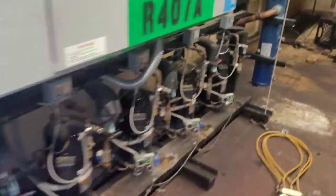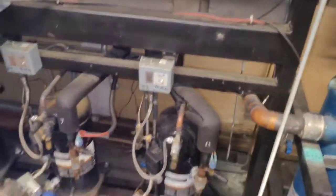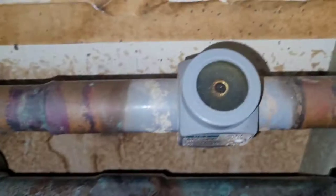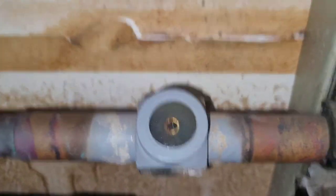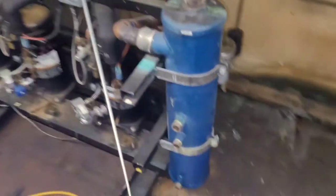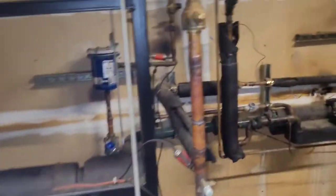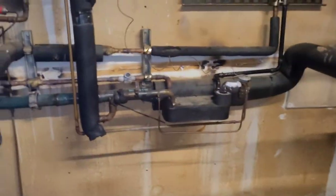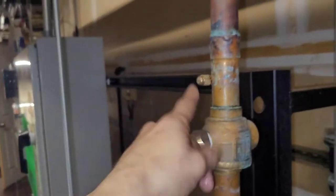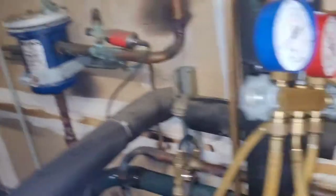Before I go on the roof I'm going to check in here, and when I find the leak I'll show you. Now it's flashing — you can see that the liquid line is not full of liquid all the time, and it should be. This line right here is the oil separator, it'll have discharge pressure on it. I found suction pressure right here — suction, liquid, discharge — got my gauges on.